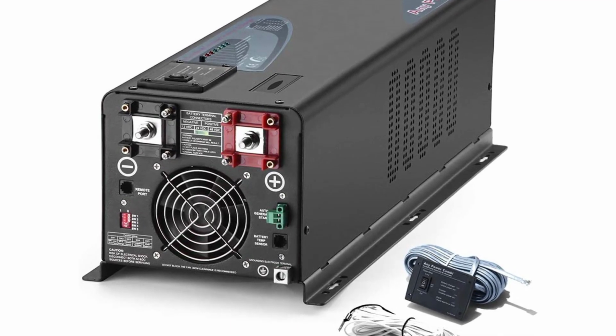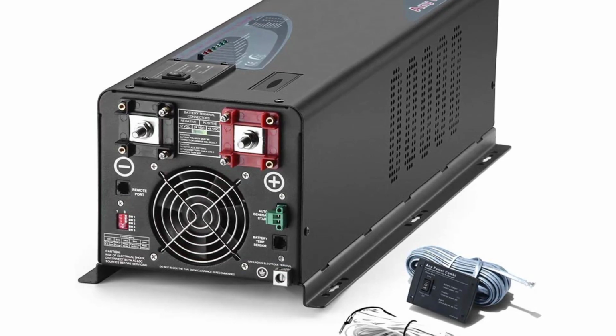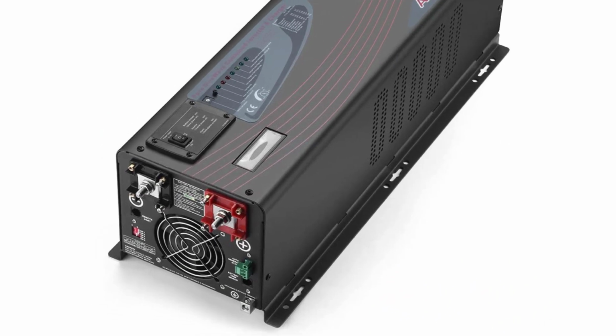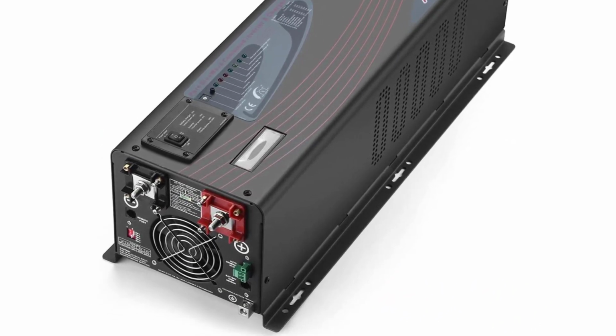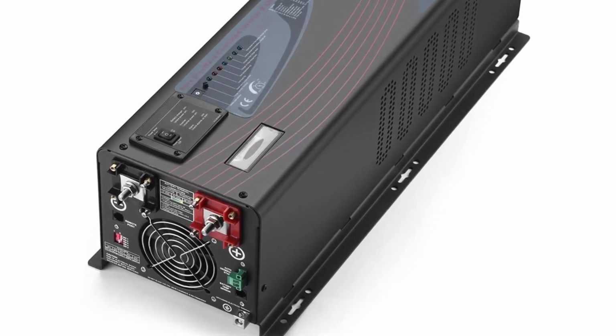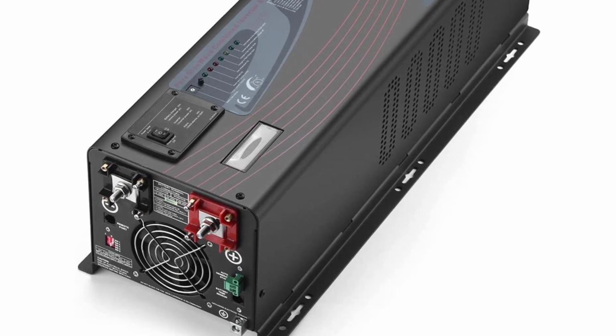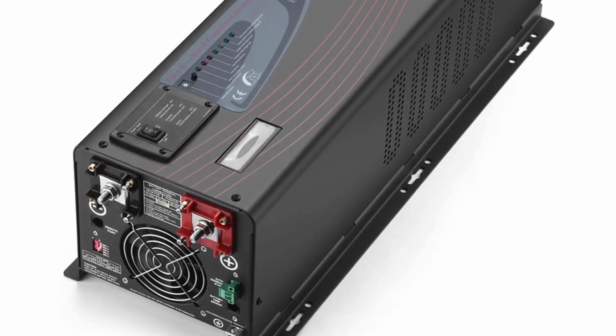Adjustable charging current. The max charge current can be adjusted from 0% to 100% via a linear switch at the right of the battery type selector. This will be helpful if you are using our powerful charger on a small capacity battery bank. The linear switch can effectively reduce the max charging current to 20% of its peak. Choosing 0 in the battery type selector will disable the charging function.